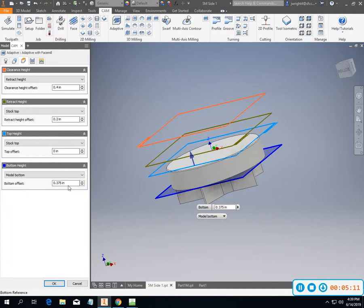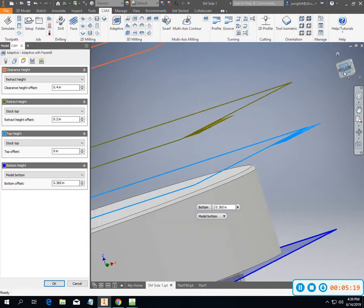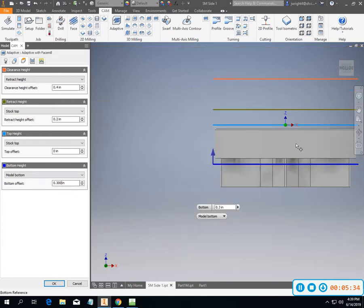maybe I'll let it go down just a little bit below it. So I actually want to mill on past that just a little bit in case I got some corner radius, and so let's maybe go 305. Actually, I would struggle with 305. So I'm going to go down 300. Now, as long as that clears for my pocket, I'm really good. So I've got this area all cleared out. I've got enough milled down so that I don't have to worry about any kind of corner radius.